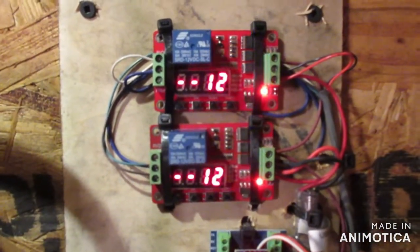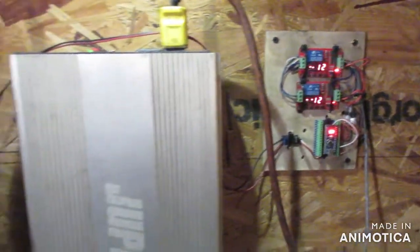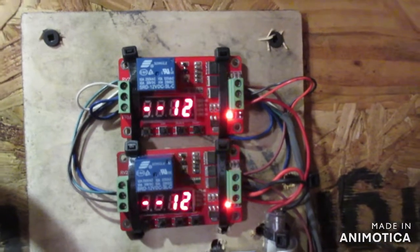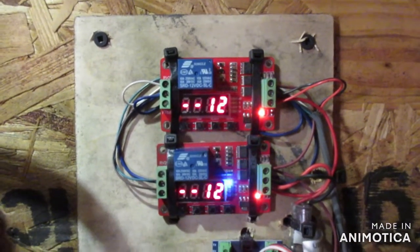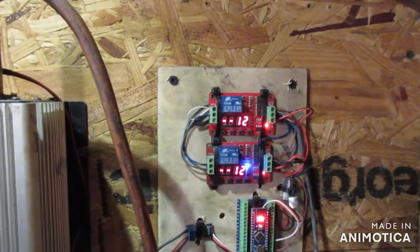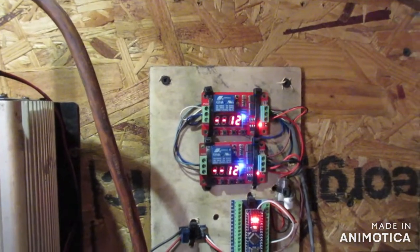That's the basic wiring. Your trigger can come from multiple sources. If you have an inverter that has an AGS built in, you just use one leg going into the trigger terminals of these boards, and then the other side of that goes to a positive output from your battery. All that is the relay in your inverter, so when the inverter sees that you need a charge it'll close that circuit and trigger the relay boards.